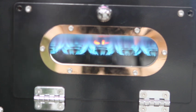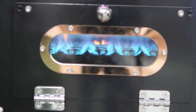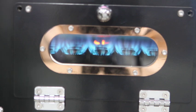Keep in mind this is an LPG roaster — in other words, a propane roaster. If you were roasting with natural gas, the flame would look different and the pressure would be dramatically lower. In a setup where you've got seven inches water column, your kPa would never go past one and a half to one and three-fourths kPa. So your burners and flame would look different, and you would definitely not get the same pressure.